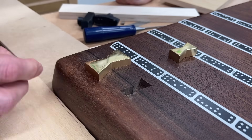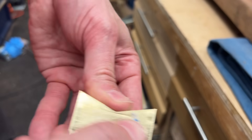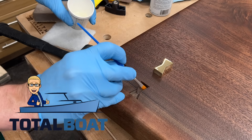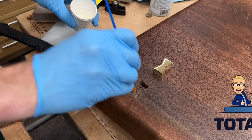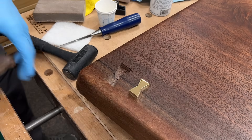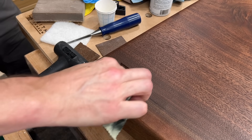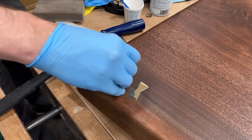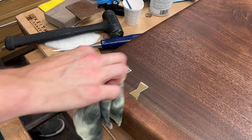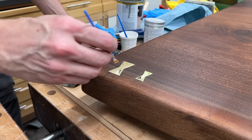And now the moment of truth. That one fits nice and tight. And the little guy looks like that's going to work too. I also roughed up the bottoms and the sides with some 80 grit sandpaper just to give it a little more bite when I put the adhesive in there. And by adhesive I of course mean Total Boat — that's right, a little high performance epoxy. I just used it a little bit — I didn't want to flood this opening with epoxy and then have it bubbling out the sides when I push the bow ties in. And I'm just using a rubber mallet and this little crubber here — cork rubber — a soft pad so that when I hit it, it doesn't dent or damage the brass. And then with the small one safely in its home, I could move on to the big one and use the same process — a little mallet with a little crubber — and get it seated securely. And then with a polishing cloth, just clean up any residue. I also hit it with a coat of Osmo and then a little Renaissance wax just to protect it from tarnishing. And after a little buff, we're ready for delivery.